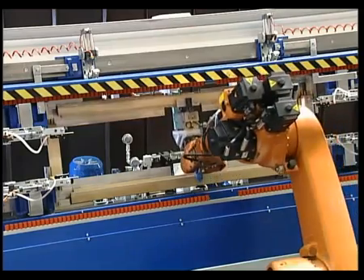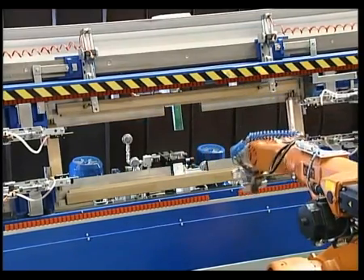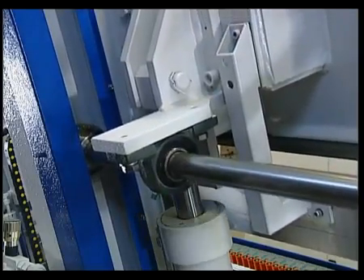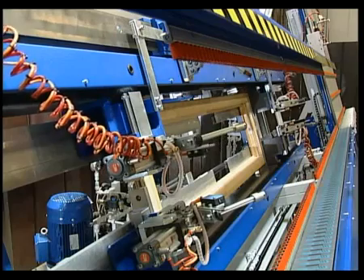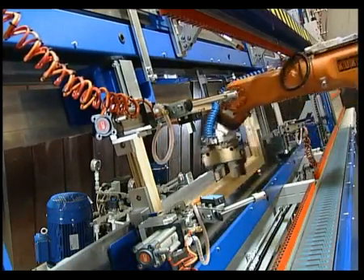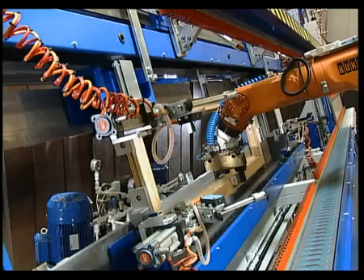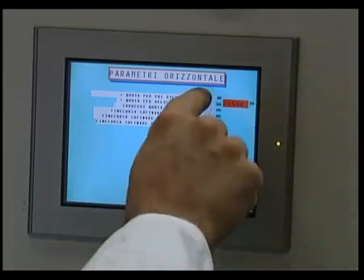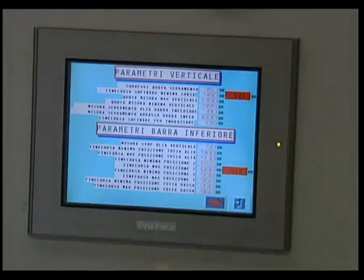A Futura CNC dimensional hydraulic press with an unloading system, comprised of a single horizontal thrust bar controlled by racks, horizontal cylinders and self-centering striker squares with worm screws and a hydraulic motor. It can easily be equipped with pressure jigs to make pre-finished frames or have surface coating for pre-painted frames. Numerical control guarantees millimetric precision in the horizontal and vertical dimensions.